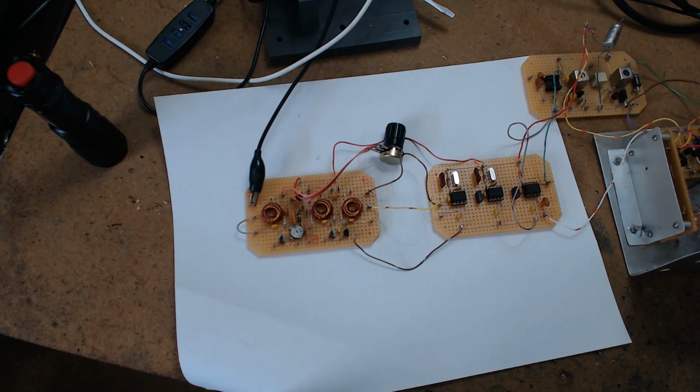So how you reduce atmospheric noise and all that, you make it a tuned circuit. So the tuned front end also starts to make the radio narrower, or better selectivity. So then you come in, you dual convert, or you just convert once, then you go into an IF strip, which makes it more selective. If you have 3 IF cans, it's going to be more sensitive than one with only 2. I look at schematics of radios before I look at the radio, before I look at the spec.